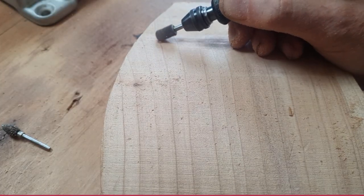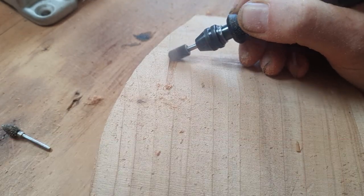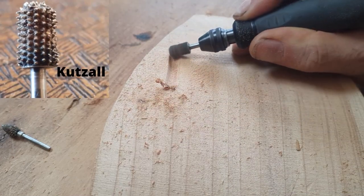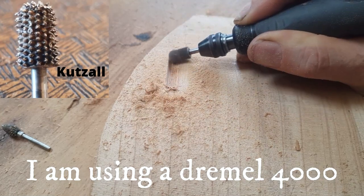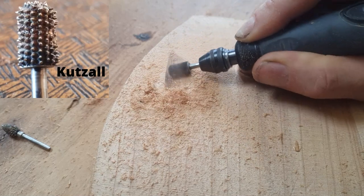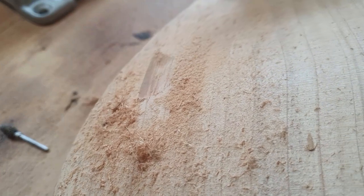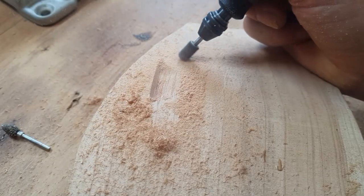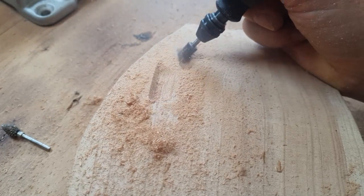On to the V-cut and we're doing it with the Cylinder Burr. The benefit with a Cylinder Burr is there's two flat sides, although the top side is a little bit rounded. So we have the benefit of having two quite flat sides — a left-hand side and a right-hand side. We've gone at quite a low angle there, so it's not exactly a V-cut, more of an L-cut I guess you would say. But it's quite clean. Going at a deeper angle, it's more of a V, and that works out pretty well.